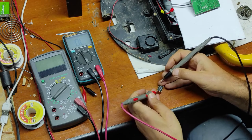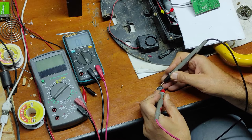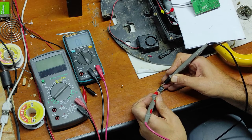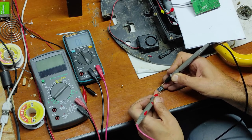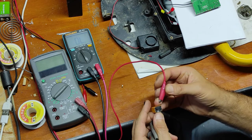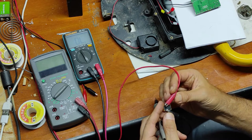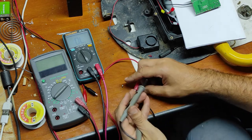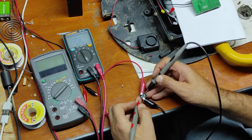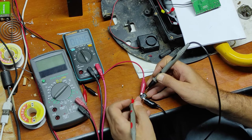First of all, let's measure again the normal closed position. This is the same wire, the output is good. Normal closed — it's not good. And now let's check normal open. The coil is good — I hear the click. And the output, normal open — now it's good.